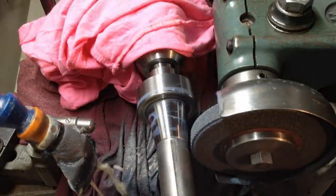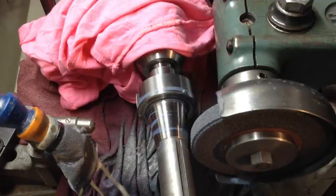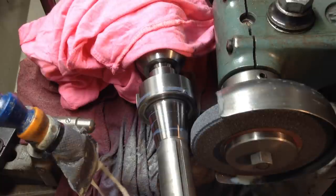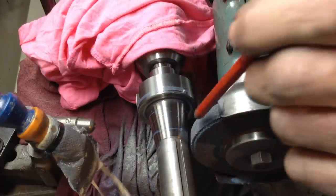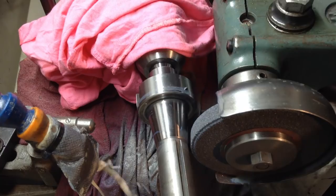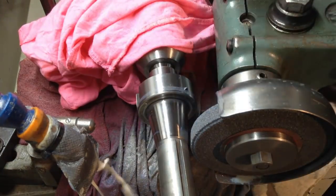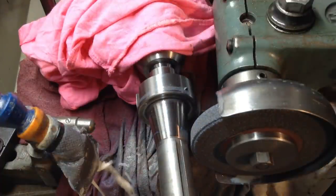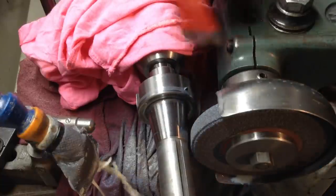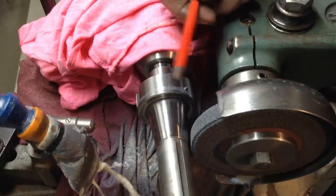Okay, this one's looking good. I can tell by the way I can hear the grinder loading up, and also when I look at the sparks, on a half a thou depth of cut, I'm getting slightly less sparks than a freshly dressed wheel, and the surface finish has improved immensely. So that's telling me this wheel's starting to dull off. It's not releasing the particles, but we're getting through it. I'll go through these wheels, what I've found out in wheel selection, towards the end of the video.